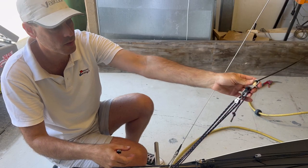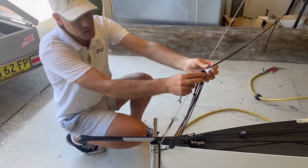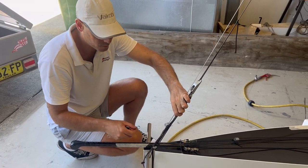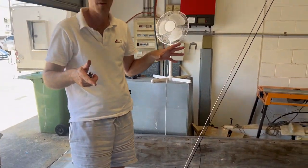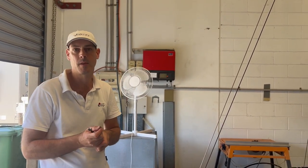That's how the boat breaker works. This knot will stop the mast from falling all the way back, so you can clip it on, get the mast in on this knot, and then tighten up as needed. It needs a fair bit of force to get this wire on. We have a fair bit of rig tension initially set up with the boat because it helps with boat handling — not having a floppy rig.